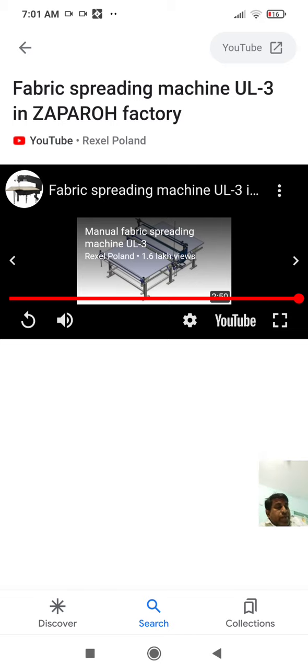Pattern parts missing. Correct number of parts for all sizes not included by the marker maker. Mixed parts. Parts not correctly labeled in the marker, therefore a marriage of wrong sized parts. Patterns not facing in the correct direction on napped fabrics. Please look into the dictionary: what is napped fabric? Patterns not facing in the correct direction. Patterns not all facing in the same direction.